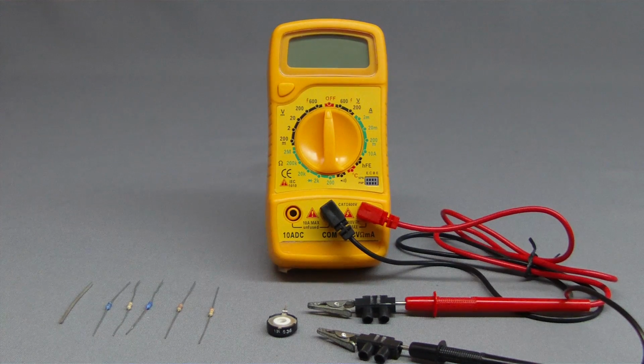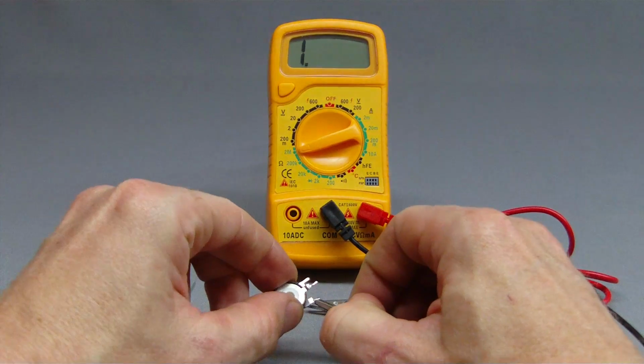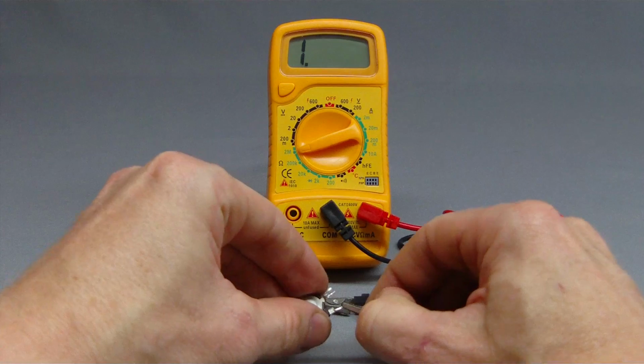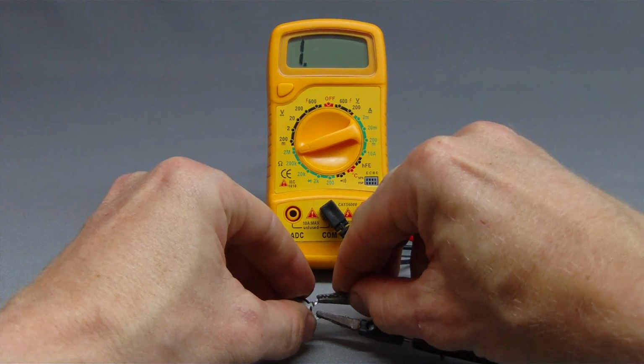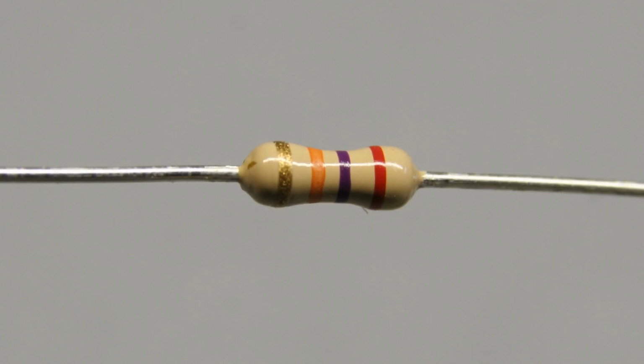While using the direct method of resistance measurement, the jacks of the multimeter are connected to the internal battery. The current running through the test device depends on the voltage output, and those variables are scaled to a resistance value. First I will attach a potentiometer to the clamps of the multimeter. Even while adjusted to the maximum value, the measured resistance is just 846 kΩ, which is clearly below the printed value of 1 megaohm. Let's discover the resistance of some carbon film resistors now.